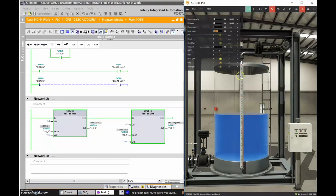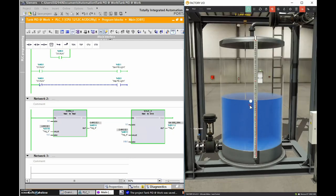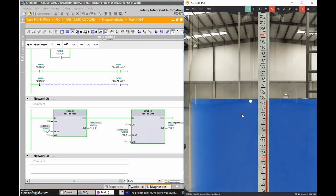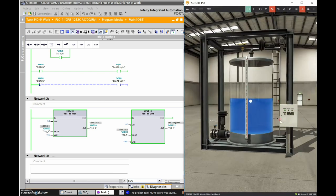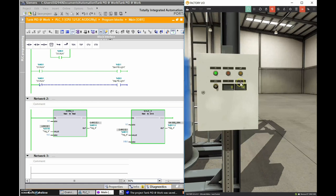In this video I'm going to show you how to take the level tank here and display the actual level from the level sensor. There's a level sensor right here - it doesn't tell us what type it is, but it gives us a 0 to 10 volt analog output depending on the level in the tank. Right now the level is about 150, and we want that value displayed on this digital display. Our process variable right here is at 150, matching exactly what we have in the tank.